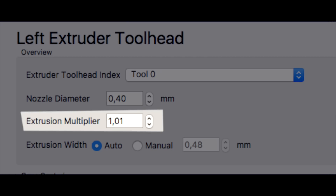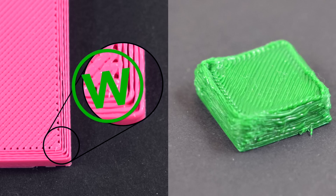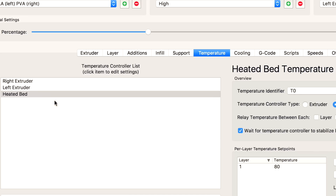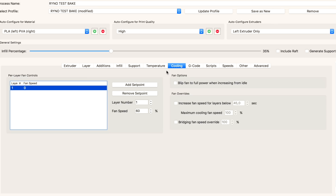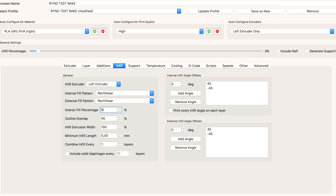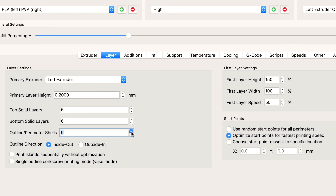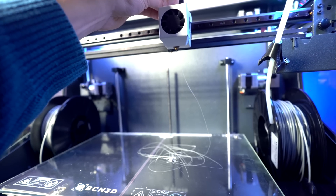The extrusion multiplier value determines how much plastic the printer prints out. If your print is under-extruded it looks like this; if it's over-extruded it looks like this. The print quality troubleshooting tutorial on Simplify3D's website is maybe the best tutorial I have ever seen — hats off for that. I checked the dimensional accuracy of the prints, adjusted the print bed temperature, adjusted the print temperature of the hot ends for PETG, adjusted the cooling fan speed — in the end I turned it off completely — adjusted infill percentage, outline overlap to avoid gaps between outline perimeters and infill, amount of outlines, and amount of top and bottom layers. I adjusted printing speeds. Too fast printing speeds give ringing, and too slow can clog up the nozzle, which I succeeded in doing twice.